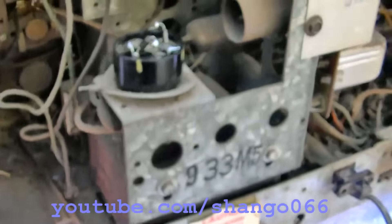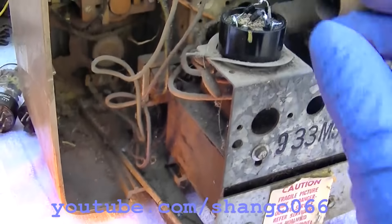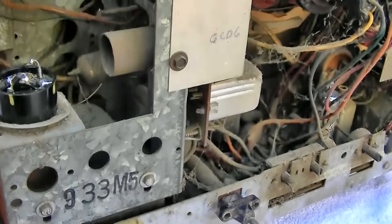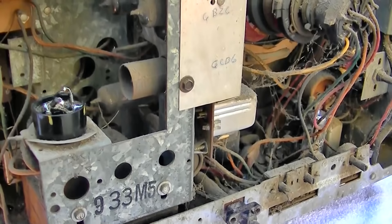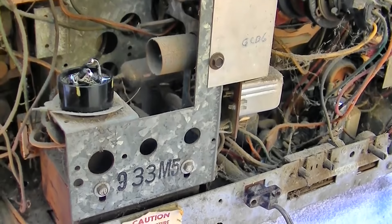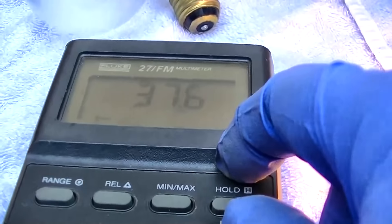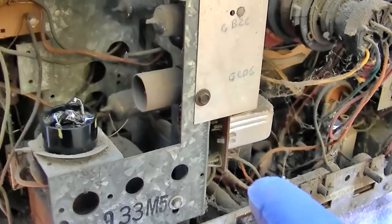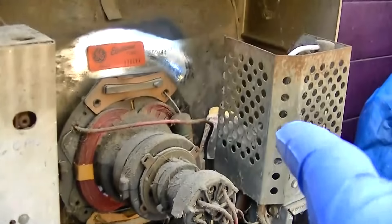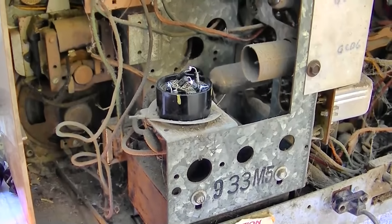Wow, there is a hell of a draw there. On the B-boost, the B voltage — B+, not the B-boost coming out of the flyback, but the actual B+. That's a hell of a lot of draw because at 37 volts there's nowhere near enough voltage on the filaments for the tube to start conducting. And we've got the two biggest tubes removed, so it's like a shorted filter or something.